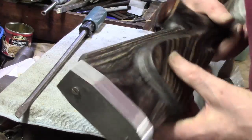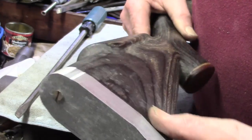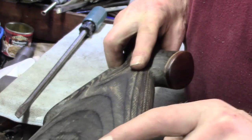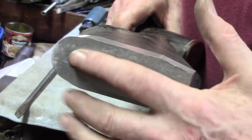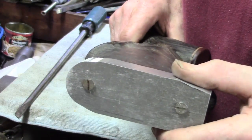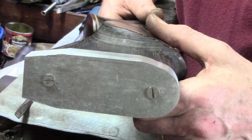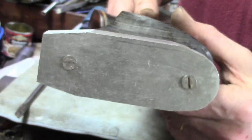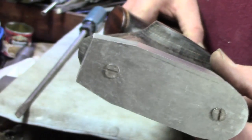Just an update — it doesn't look as if I've done much, does it? That was the bit I did on the rotary table. Cuts down the side took a long time. I've trimmed off a little bit of corner there. Screws are in temporarily — I had to get that drilled and set into the stock for accuracy so I can finish the final shaping, which is going to be basically by hand: belt sander, just about any damn thing, to get that down to near the final. Then we start finishing and polishing and get this dished out and shaped. Quite a lot to do — surprising, really.